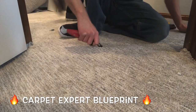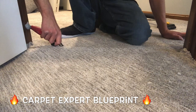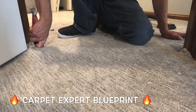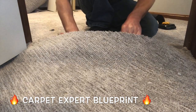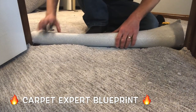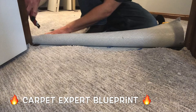So here we have a doorway — it's an angled doorway. Very simple pattern, just random rows, different color lines. All we did was line the bedroom up with the hallway so everything was good to go, and you saw in the beginning of the video where I cut a nice straight line with my knife. Next, as you see me doing right there, I was marking the carpet all the way down with my knife, just poking little slices in it.